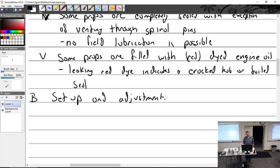Take off the propeller and put the engine end down into the bucket so it drains. It sits quite nicely on a bucket because props don't sit well on the floor. Most mechanics will take a rag and shove it down into the crankshaft flange - and forget about it. I recommend covering the hole, but do not shove the rag down in there. I heard a story: somebody's prop wouldn't work and when they took it off at the prop shop, shredded rag came out - they had to take it all apart and pull out all the rag pieces. So cover it up, don't shove it in.